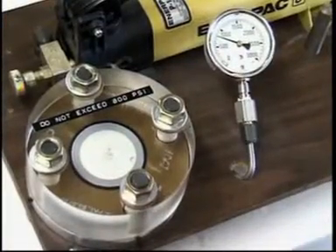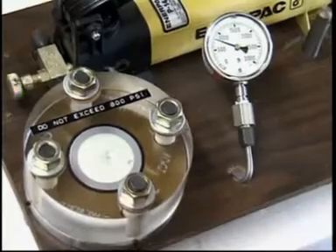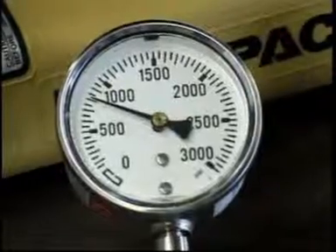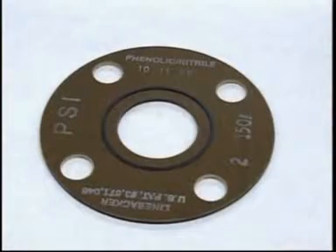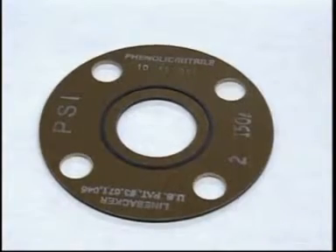But that's exactly the point, as we'll now demonstrate how the Linebacker will easily hold over 800 pounds of pressure with the same torque applied to the flange nuts. The Linebacker is labeled as to the brand of the gasket, the material makeup — in this case a phenolic retainer with nitrile seal element — pipe size, and pressure rating. The gasket is also date stamped. With the wide variety of Linebacker retainer and seal elements available, these designations ensure the correct gasket is installed for the intended application. The Linebacker sealing gasket is manufactured in accordance with ISO quality assurance specifications, guaranteeing it is produced according to a specific quality assurance program monitored and subject to periodic audit by an independent third-party certification board.